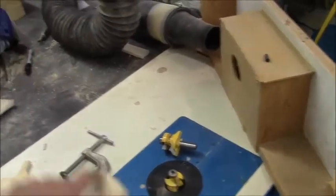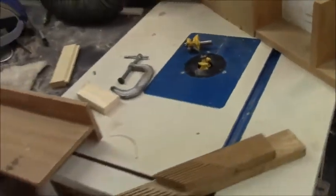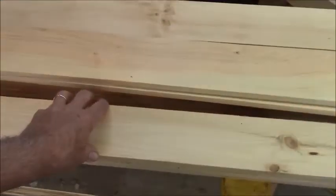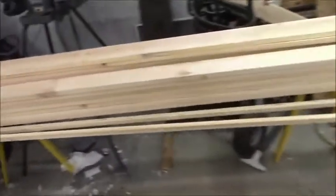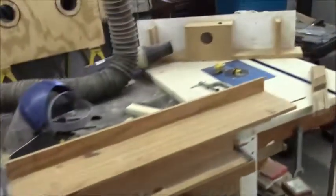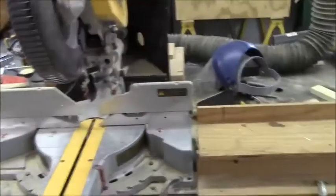I have set this up. The tongue part of the groove eats up three-eighths of an inch, so I will have boards that are three and one-eighth inches wide. I used three point one two five instead of three point five to figure out the widths I need, to compensate for what width I'm going to lose by cutting the tongue and groove into the edge of each board. So we're just going to set this up with a stop block and cut thirty-six of those suckers.